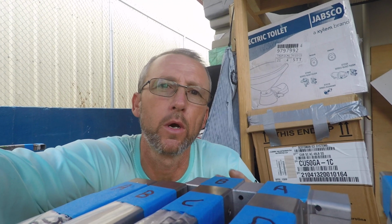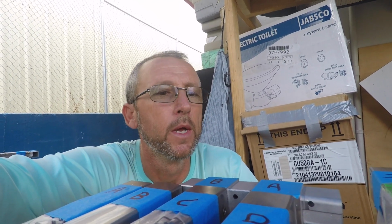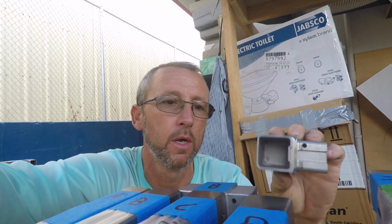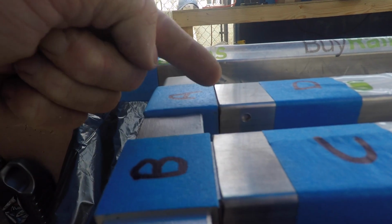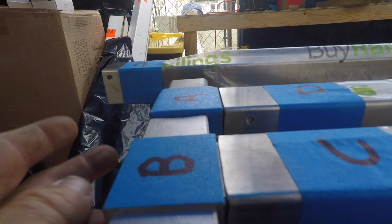One little tip that we learned whenever we built the first arch out of this material is that the corner pieces have a slightly different geometry, and they're actually from a different manufacturer than the tees. So what that means is the piece that goes on the elbow needs to be about 3/16 shorter, if you can see from this angle. This is about 3/16 shorter than this leg in order to get the outside dimension of the assembly flush. That is not 3/16 on both ends, that's 3/16 overall. The geometry for the elbow is probably about 3/32 difference, but we find that if we order the outside perimeter, basically anything that touches an elbow needs to be 3/16 shorter.